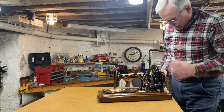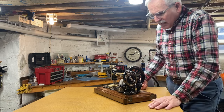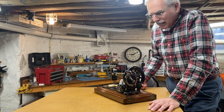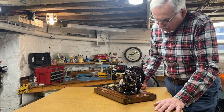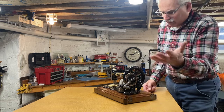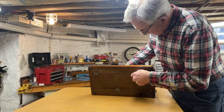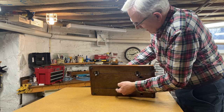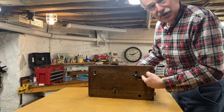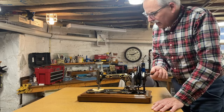To use this machine, the first thing you have to do is fold up the crank handle. This is an original Singer crank handle — a lot of hand crank machines you see nowadays have a cheap Chinese-made attachment, but this is a Singer original. It's actually kind of nice because you can flip this little lever out and that disengages the hand crank, which is how you convert it to treadle power. You drop these little fold-down tabs and those fit into holes in the base of a Singer treadle cabinet so it's in exactly the right position, with holes already drilled for the belt from the treadle flywheel to go around the hand wheel.